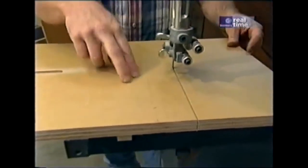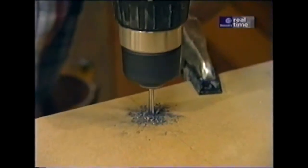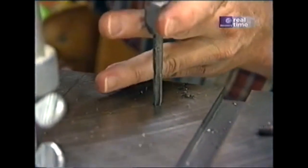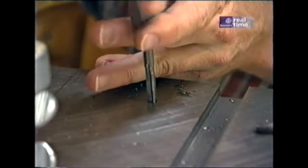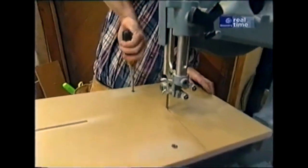The next thing is to attach the jig to the cast iron table. I'll clamp it in place and then drill some holes all the way through the plywood and the metal. The first pass with the drill was just a pilot hole, and now I'm going to a larger bit. I put a little oil for lube and drill all the way through. Now I'm going to tap it for the bolt I'll use to secure the top, using a tap you could buy at any hardware store. I start it in with a little bit of a turn, feel it bite, back it off to get the waste out, and continue until we get all the way through. If you didn't want to go through this process, you could drill a hole large enough to put a through bolt with a nut.